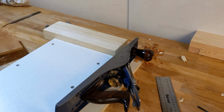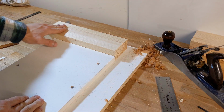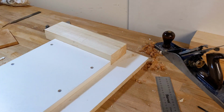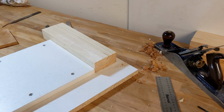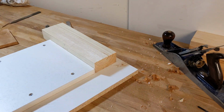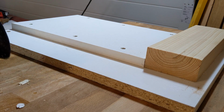It's all cut clean. And like I said, ideally, if you make one this way, give that glue 24 hours to set off, and you can make sure that fence is super tight. But that's it. You can knock up a shooting board that's perfectly acceptable out of scrap that you've got hanging around, and save the up to £250 that you might spend on a shooting board, on timber and things that are probably more useful for making projects.